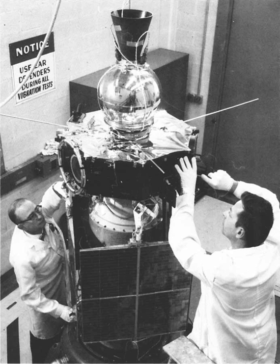The Ames magnetometer experiment consisted of a boom-mounted triaxial fluxgate magnetometer and an electronics package. The sensors were orthogonally mounted, with one sensor oriented along the spin axis of the spacecraft. A motor interchanged a sensor in the spin plane with the sensor along the spin axis every 24 hours, allowing in-flight calibration. The instrument package included a circuit for demodulating the outputs from the sensors in the spin plane. The noise threshold was about 0.2 nT.